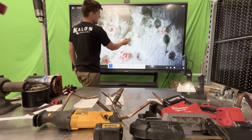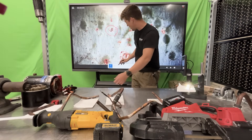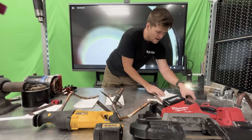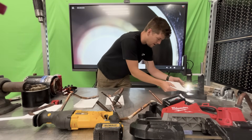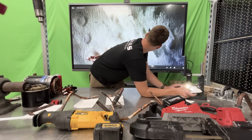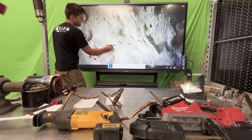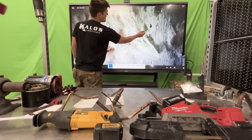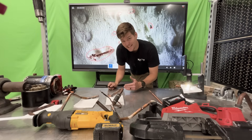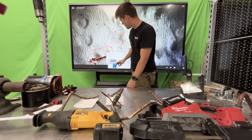This is from cutting two connections at a vertical rise point. The idea that gravity somehow takes these copper particles and only pushes them down — there's contamination, so that claim doesn't hold. Now looking at our second piece on the liquid line — obviously a smaller line, but it tells the same exact story. There's an even bigger piece right there. You might say those are tiny particles under a microscope, but any level of contamination — any copper shavings — creates a problem. Survey says that's incorrect: it does create contamination even with a bandsaw.